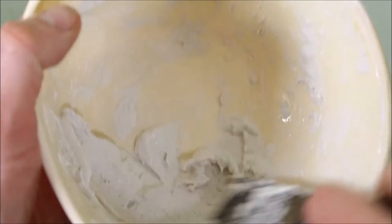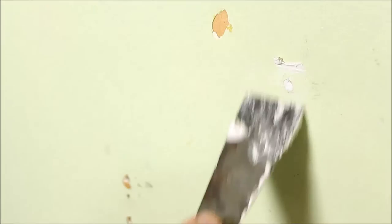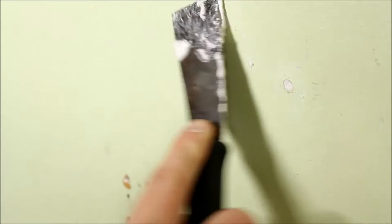You want to go ahead and fill any holes that are in your walls, or in my case any little bunches of paint that came off when I was removing that putty. I don't really like that putty anymore — it does more damage than good. My walls are plaster and lath, not drywall, so there might be some additional steps I have to take. After your patch is dried, you want to go ahead and either sand it or at the very least wipe off the excess dust.